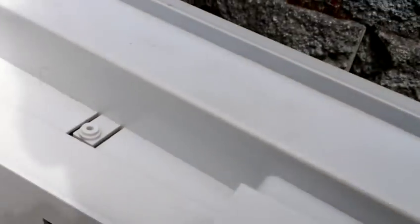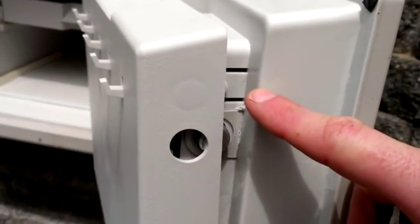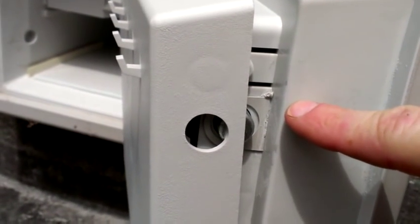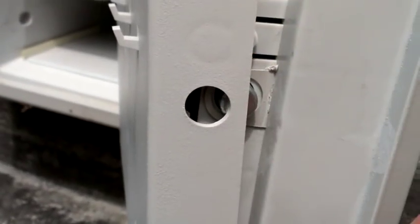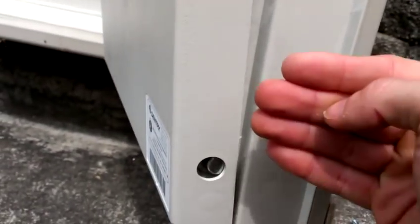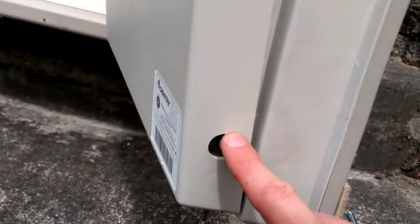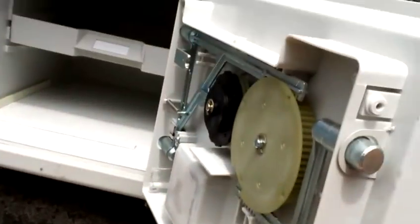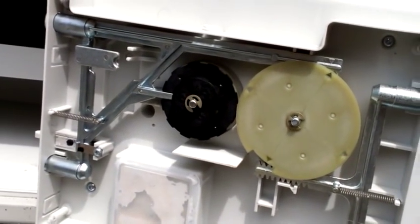Once that's done you'll be able to see this other knob up here pretty clearly. On this side they're not as visible, but if you look through the side you can see there's a circle in this piece — the plastic is actually a little bit different. You can sort of see the deformation where the mold put this knob on this side. Then you pry this apart, over a little bit to get it off of both locking bolts and off of the little plastic retainers. Pop the back off and inside you've got a very simple, easy-to-understand locking mechanism.